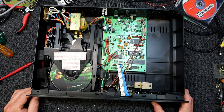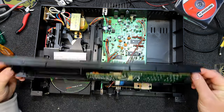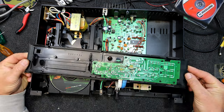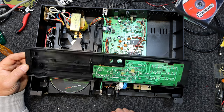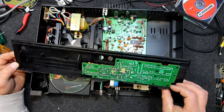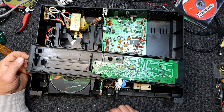So it could be an interesting one - it's actually got an electronic fault but it does seem to play the disc alright, so at least the laser and everything seems to be running in it. I did quickly pull this off and have a quick look. I was thinking maybe just this microprocessor type chip was running these segments to the display, but when you actually look here there's some sort of driver chips. Some of the solder joints on this don't look the best either, so maybe I should go over those. It might be worth resoldering a couple of those chips.